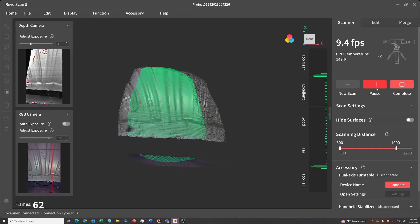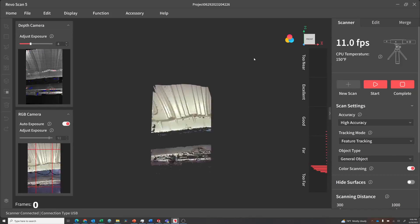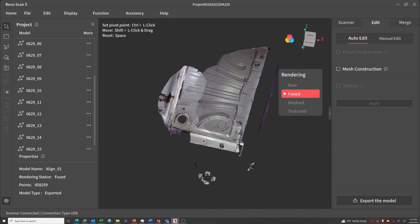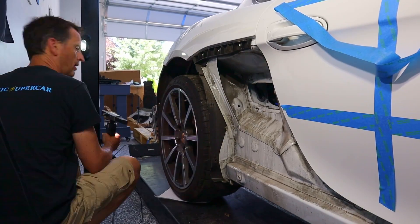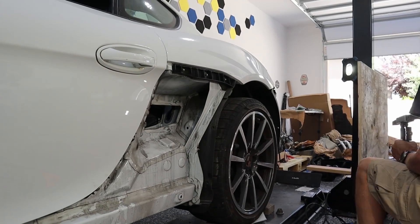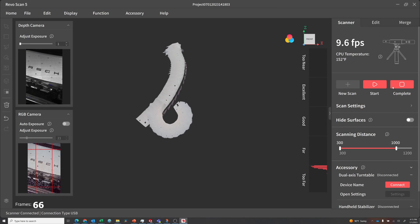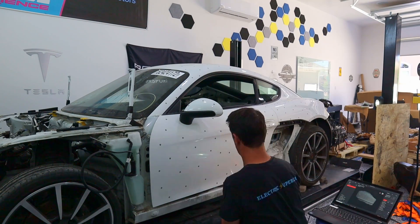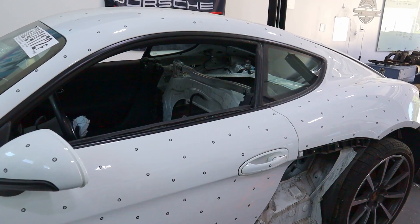As long as we're scanning, I'm going to scan the rear motor bay as well. This will be the spot for both the rear motor as well as the battery pack. So I've got a few scans here. Besides just getting the 3D image, the scanner moves around from place to place to capture larger objects. The 3D scanner has built-in programming that can keep track of features as you're scanning — this does best when features are not reflective and not big flat surfaces. For bigger areas I struggled with feature tracking, so I put dots on the car, which really improves tracking.